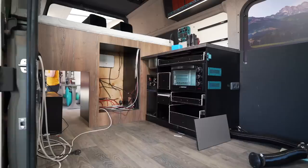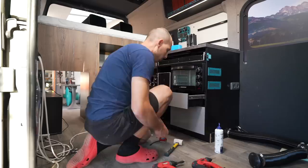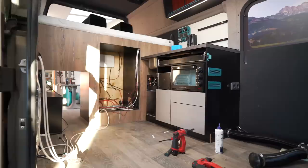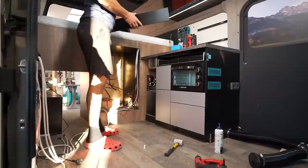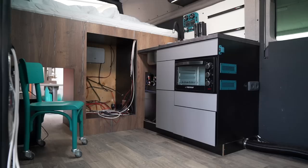I used 14mm lightweight plywood for the carcass of the unit and around 8mm for the drawers — that was right on the edge. It's kind of difficult to get short enough screws to attach the runners, but I think it's worth it because that really made it lightweight. The heaviest part feels like the runners. I measured three times just to make sure these handles are exactly where they're supposed to be, because there's no more adjustment once you drill the holes.